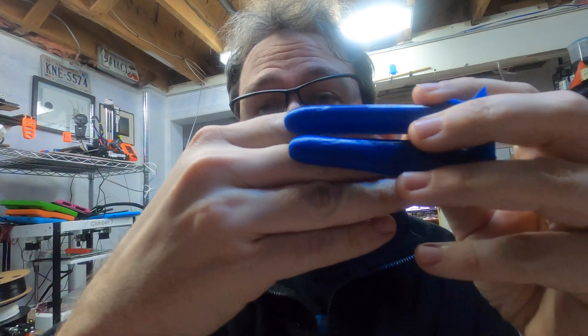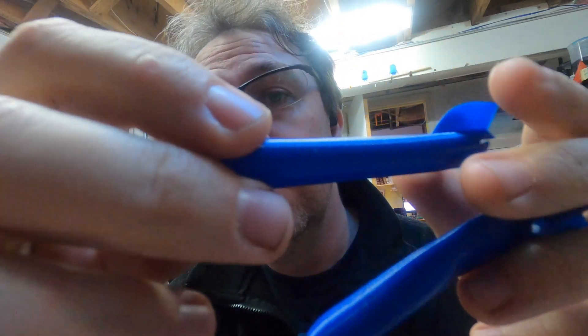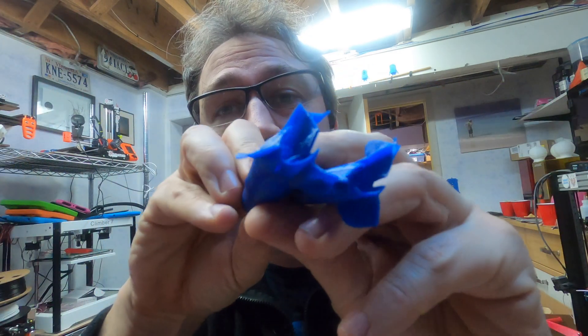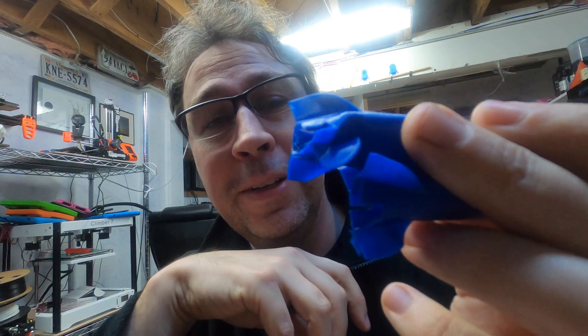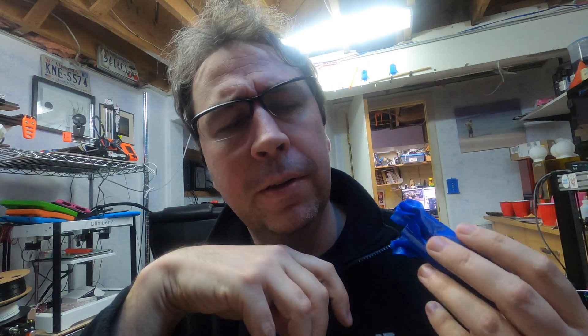Well, it seems we haven't quite solved the problem of getting the rockets off the bed, but I do like to do test prints live. Those are the first prints on that skirt and the print quality is just beautiful - no seams, no hiccups, TPU at full speed. The back of the rocket where it took a trip underneath the bed has a little mangling going on. I think just letting them cool a bit more and maybe adding more of a raft layer - a thicker layer to help it eject - would work. I'll experiment with it. Till then, thanks for watching and happy printing!